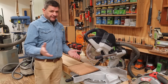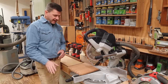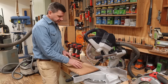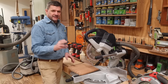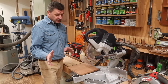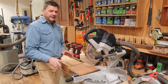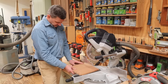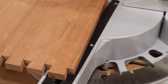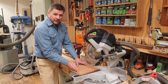I decided to go with the five-degree angle — and that's what it turned out to be, a five-degree angle. So I'm going to cut that before I cut the half-moon shape so I have more support against the fence. This saw does have a laser, which I very rarely use, but it happens to be very helpful here — I've turned the laser on, set the fence at five degrees, and I can see exactly where the blade is going to cut. It's right there at zero at the bottom, and it kind of splits this tail right in half.